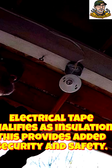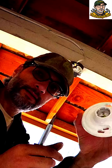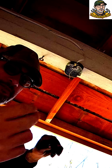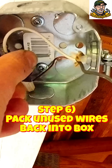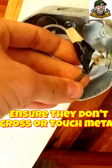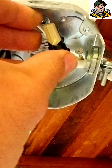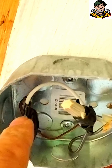Now I can go ahead and handle the neutral side. We have our light socket that we can install. Because this is going to be a live circuit once again, we're just going to practice safety and go ahead and nut this one off. Pack it back into the box for safety — now there's no way that it can cross over and touch anything it shouldn't. Pack it so the hot is not touching anything metal, and the neutral is packed up out of the way so they don't have a possibility of crossing over and shorting.